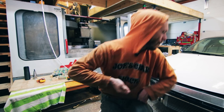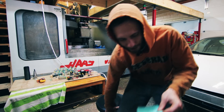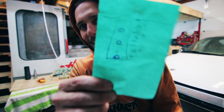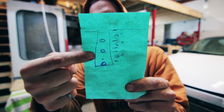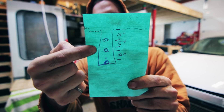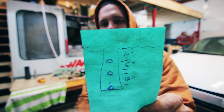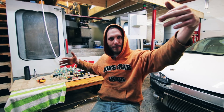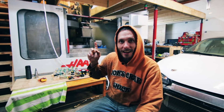I did the power at 36 inches, and the gas above that, with 12 inches of dirt. Then above that I did the communications conduit just a few inches, and then I covered that with another 14 inches of dirt. So all three in a row. But as I was putting that dirt in it was starting to freeze, and it was just such a pain. I actually wrapped the dirt in a nice big blanket overnight to keep it warm and keep the snow off it, which helped a bit.